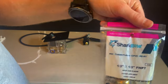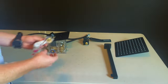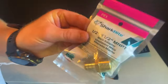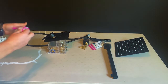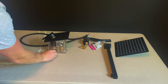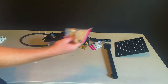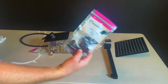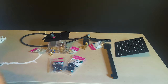First up with additional items: half-inch to half-inch drop ear elbows — one going to the PEX with a shark bite fitting and a half-inch threaded fitting for the wall stub out. I needed two of these for the wand and the shower head. Next, half-inch to half-inch male adapters — threaded on one side, PEX fitting on the other — need four of these: hot, cold in, and then out for the shower head and out for the shower wand. I also got some half-inch PEX crimp rings.